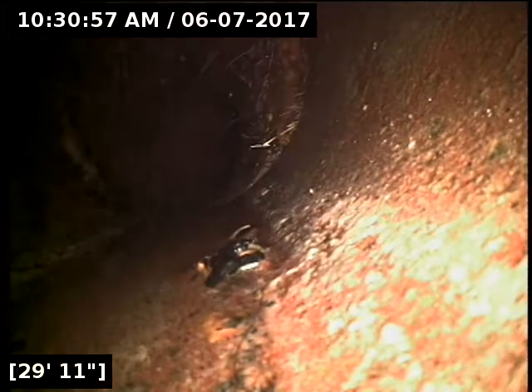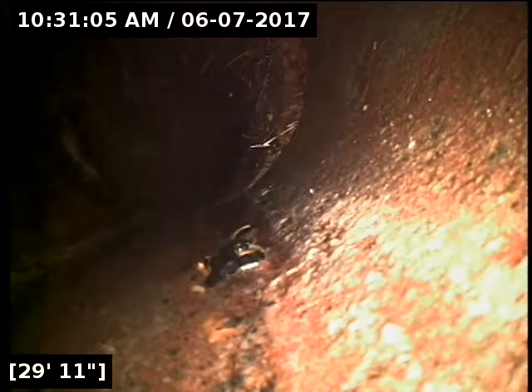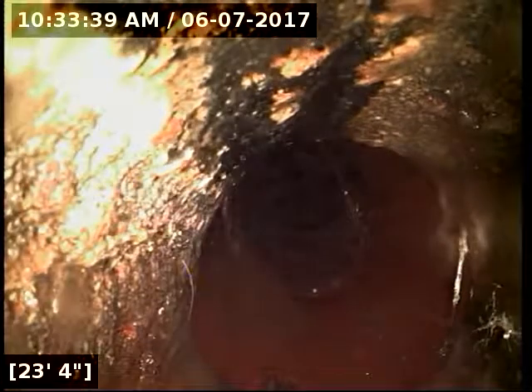I just attempted to locate right here — I'm picking the signal up underneath the front stairs. It's about the second stair up. From this point I'm not really able to locate. I'd recommend doing the liner, because at this point the line goes underneath the front porch and then angles across the whole concrete walkway and then across the sidewalk — it's seven to ten feet deep. You're going to save a lot of money doing a liner in this situation. I'd recommend a re-scope after the lining is done to ensure it was done properly. Contact the city about the furthest-out root intrusion at 65 feet, as that is in the road.